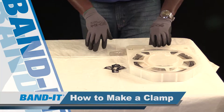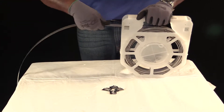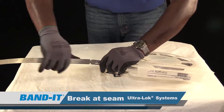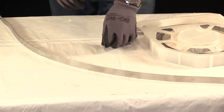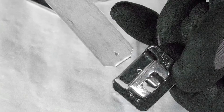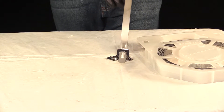Let's make a clamp using our free end Ultralock clamps. First, we're going to break off a free end band from the roll — pull it out until we see the seam of the next clamp and bend it over until it breaks. Now that we have our clamp broken off, we want to attach the buckle to the clamp. Slide the buckle into the band with the indented arrows pointed in the same direction and the same side up, then slide it down the band until it stops in between the two dimples at the opposite end of the free end clamp.